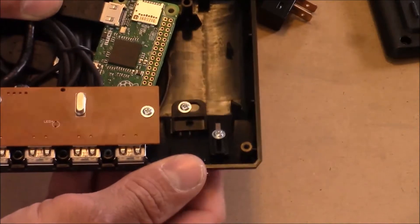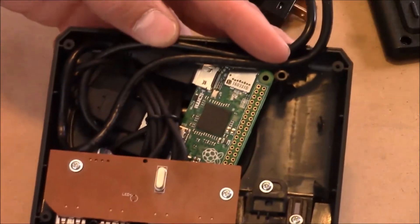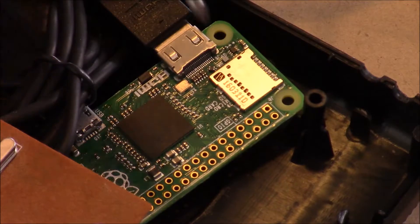I'm using a Raspberry Pi Zero board. If you follow my tutorial on how to build the Sega Genesis Mini, you'll need to make a couple small modifications. The biggest thing is you'll have to turn the Pi board so it's facing the other direction, with the cords going off to the left instead of to the right, because the area marked with an X is where the switch is going to go. We want to keep that area open so the switch fits in just right.